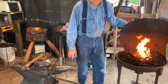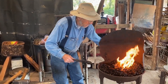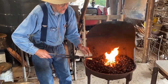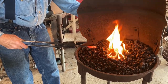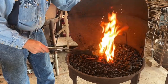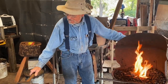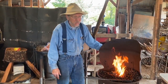The height of the anvil is a variable to suit the smith. So what we've got now is a working heat — a good bright heat. You can see the color changes as it cools down: it turns from yellow to orange to red and fades. If you lose heat, the color changes. One of my mentors says, think twice and strike once — it's like the carpenter adage, measure twice and cut once.